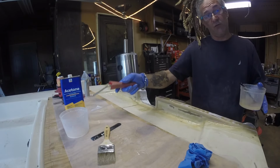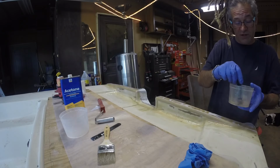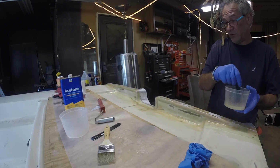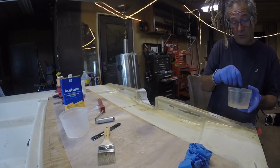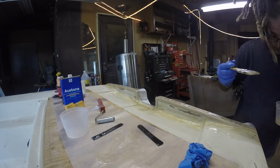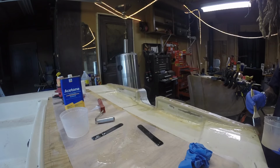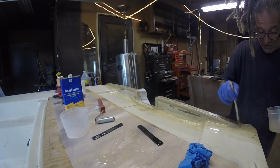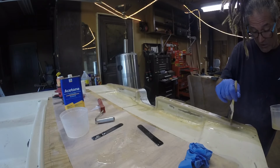And I was using my homemade roller to roll it out. It's just a billet aluminum, or whatever, piece of aluminum. Turned it down on the lathe, drilled a hole in it, and put it on a paint roller. Oh, I had to thread the end so an actual nut would fit on there to hold the roller on, but other than that, it's a lot cheaper than the 20 or 30 bucks they were trying to charge for an actual brand name one. And it's pretty much the same exact thing. If I need to get one with the notches in it, I can just machine the notches in it. I have a parting tool for the lathe, so.